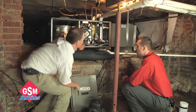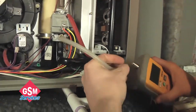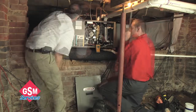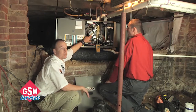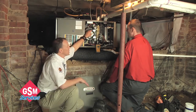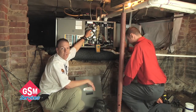Before we check unit operation, Jason is going to check what's coming out of the gas valve — we already checked what was coming in, and now we want to check the outlet. Then we're going to put the back door on, return power, and the furnace should start in sequence. The first thing you're going to hear is the inducer motor coming on — that's checking the flue to be sure it has enough pressure to properly fire. The pressure switches are the safeties telling the unit we've got it. It also checks all the temperature limits and flame safeties to be sure that if the furnace was to overheat or have an issue, it would shut off immediately. By this coming on, we know the furnace is safe to operate for our homeowner.